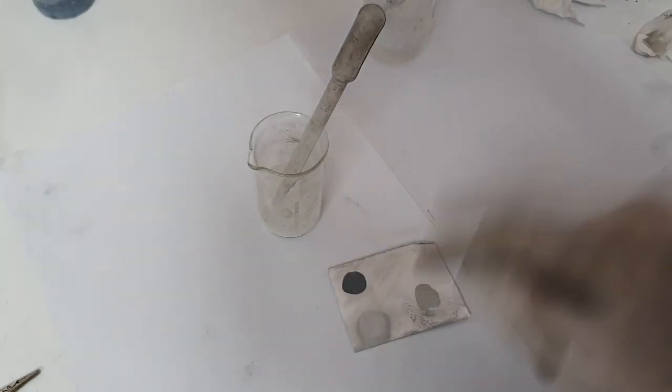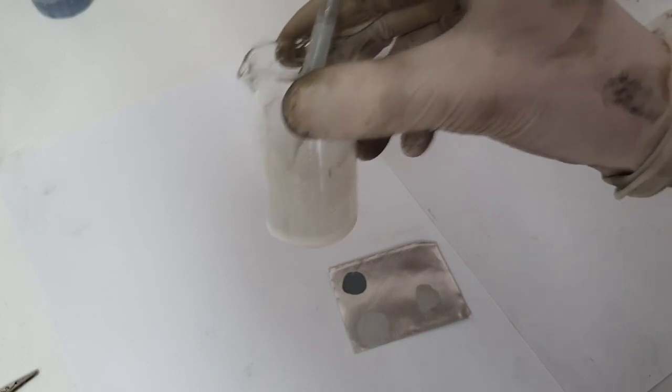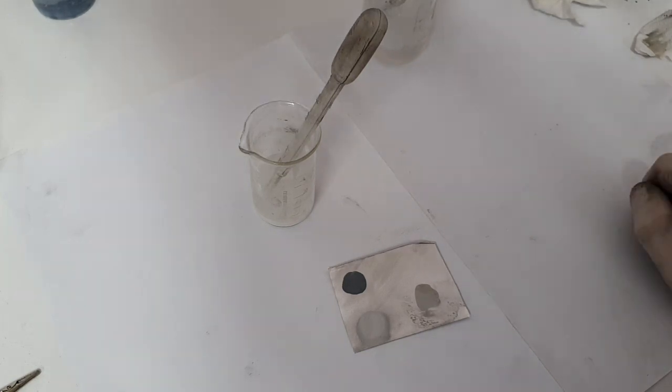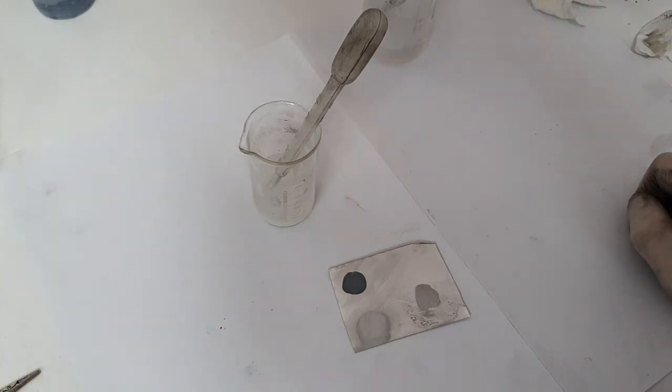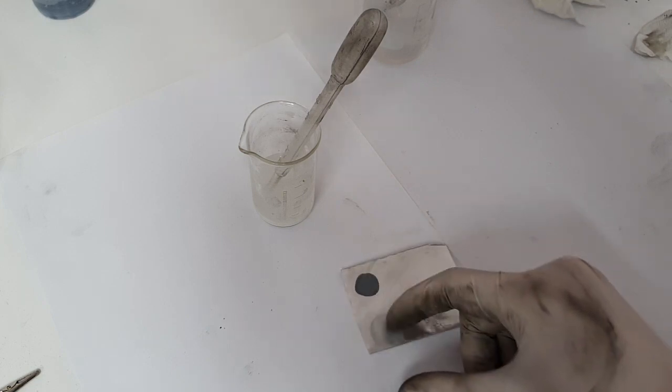To make this modified electrolyte, I put around 30 ml of 3 molar potassium hydroxide and add half a teaspoon of zinc oxide. The zinc oxide additive will only work in alkaline electrolytes. You can clearly see the difference between the plain potassium hydroxide result and the potassium hydroxide plus zinc oxide result.